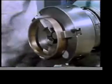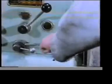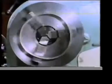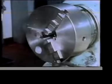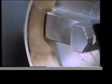It's not only cutting forces that can cause work to distort. This component is supposed to be circular. If we'd wished, we could have restrained the component from the inside using the same chuck but with different jaws. This time, less clamping force is used, and the component remains circular.